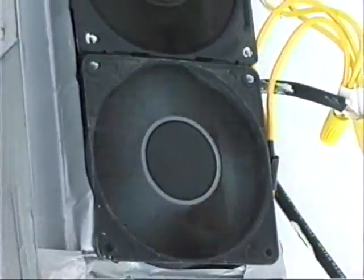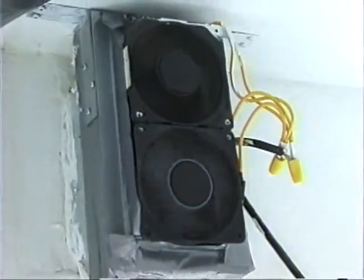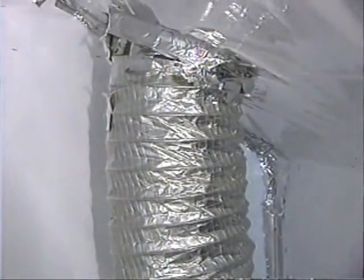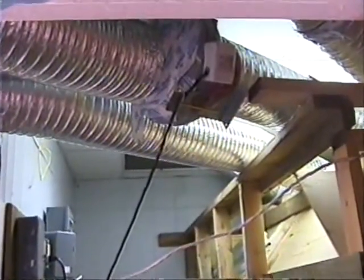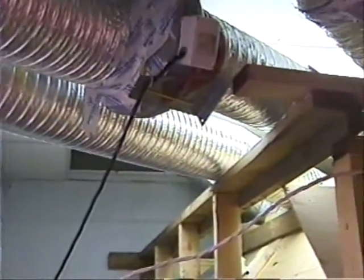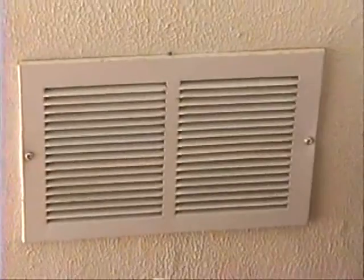Ventilation systems can be designed without actually cutting holes in walls or ceilings. A fan on the floor can easily lead to a window on the other side of some plastic, or even down the hall to another room. However, cutting a small hole near the top or bottom of a door may be the only way to get fresh air into a small area such as a closet without actually leaving the door open.